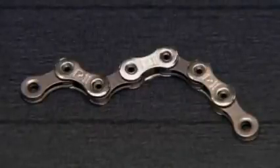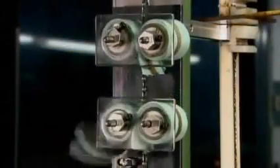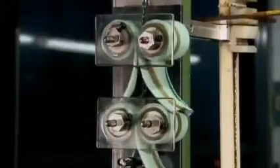The sections are linked together in one long chain, which now winds by an inspection station to be examined for flaws. After that, the chain takes a dip in hot oil, which lubricates the links to prevent squeakiness and wear down the road. The chain exits the lubricating station and travels by wads of absorbent material, which soaks up the excess grease.